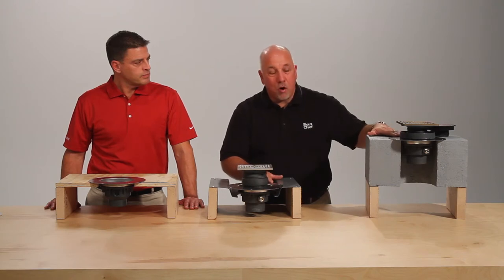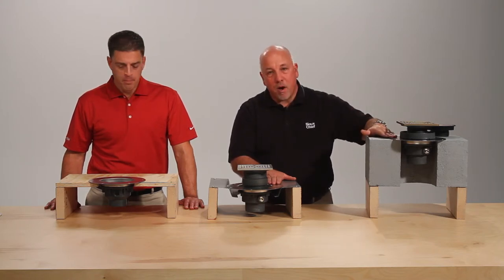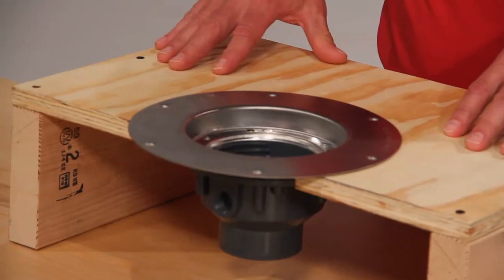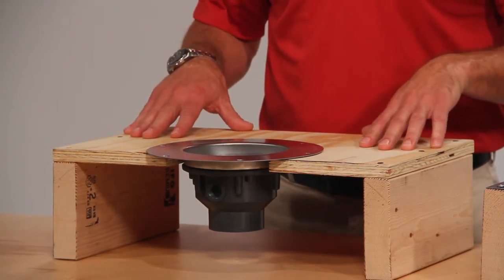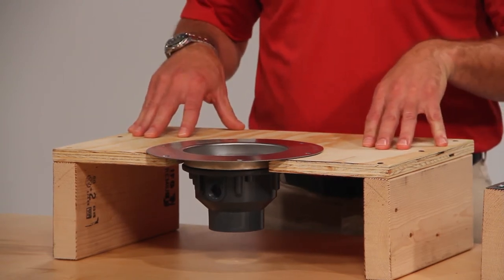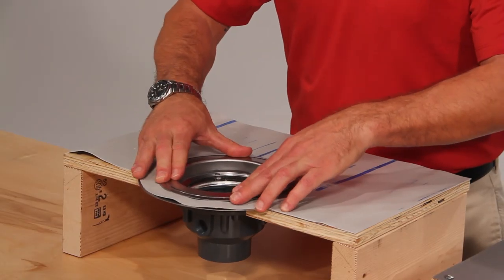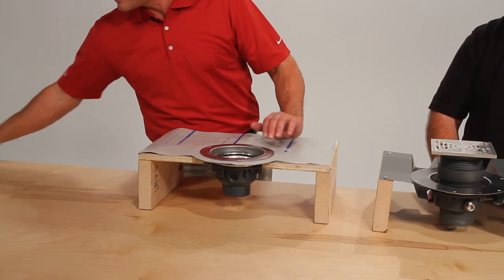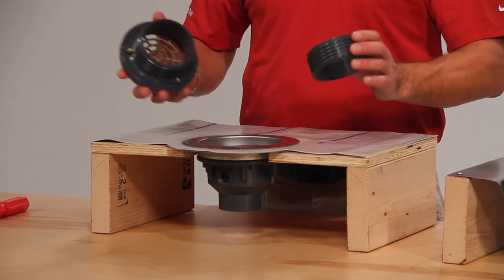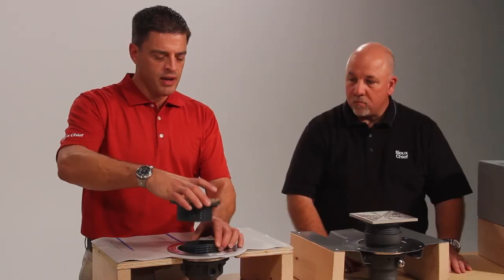Both of these applications can also be utilized with a clamping collar, which allows you to apply a membrane to waterproof both applications. The last installation is a typical wood deck installation, often found in a loft remodel or second floor utility room, where some waterproofing is needed. Simply take your membrane, lay it on top of the Halo Drain, then take your clamping collar securing the membrane in place and fasten it tightly with the provided bolts. If additional height is needed for the head, cut a piece of 3 inch PVC, glue the threaded bushing and drain head to either end, and adjust accordingly.